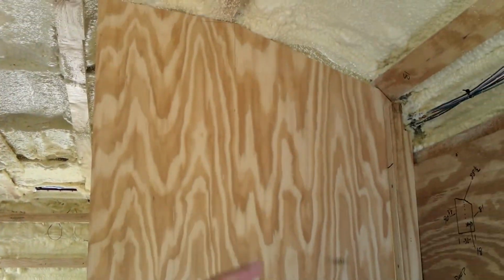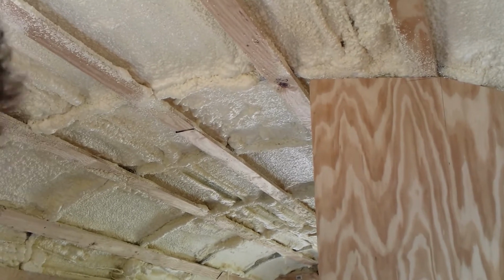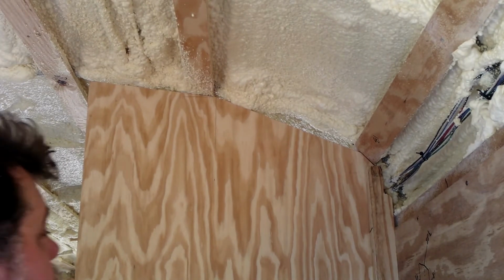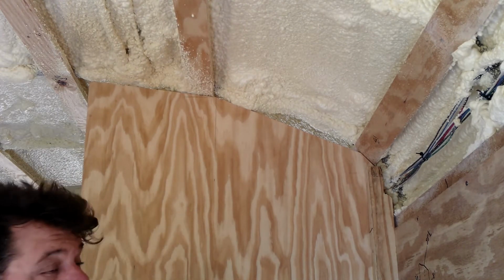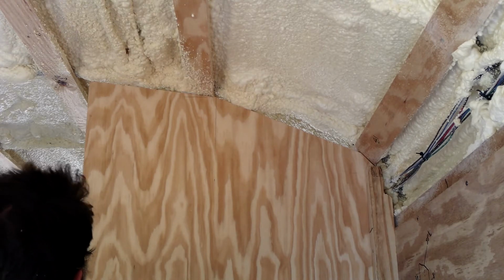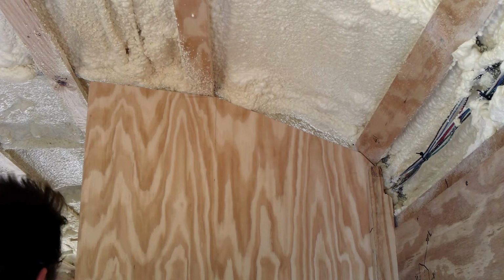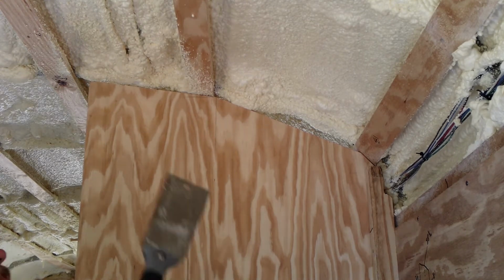Anyway, we're going to start working on these things up here. I'm going to put in some support bracing. Basically, it's just going to be some pieces of 3/4 inch. We're going to put a couple 6-inch pieces, one here, and then on the other side, we're going to do the same thing. Just to give this support so it doesn't move back and forth. That's not the only support that's going up on top, trust me. But it's the one we're going to do right now. So that'll work. Let me clean it off. Before Pops gets back in here and finds out I ain't done nothing.